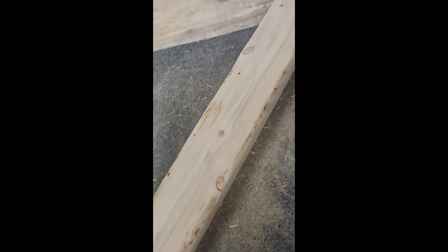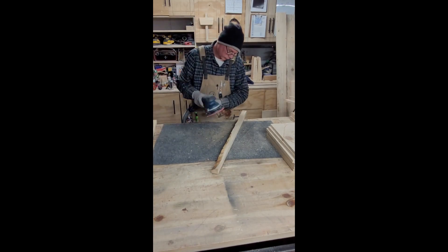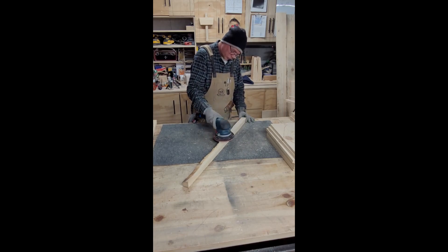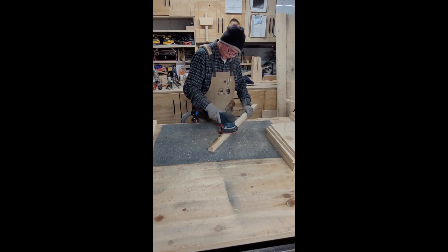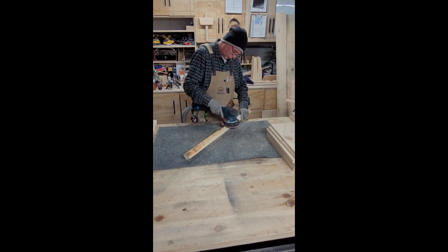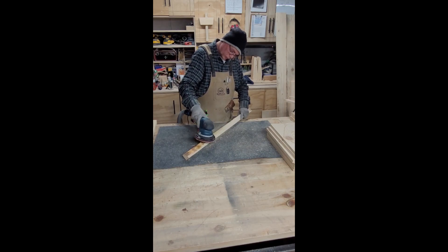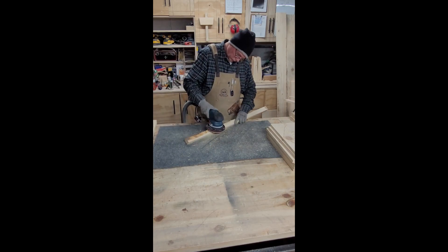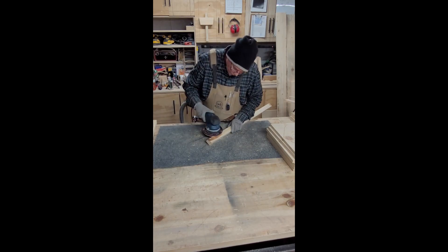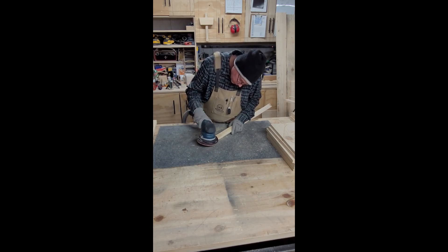So these are the little mattress slat support rails I'm going to put on. I basically took another one of those 2x6s and ripped down some inch-and-a-half strips. All I'm looking for are two flat sides: one that I can screw into the side of the 2x6, and one that I can screw a mattress support slat onto on the top. Again, using that aggressive sandpaper to try to clean it up the best we can. Sanding is not one of my favorite things, not really.